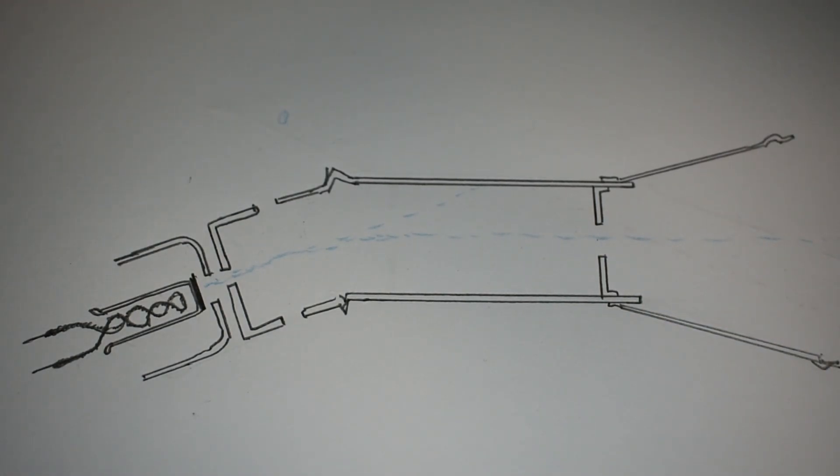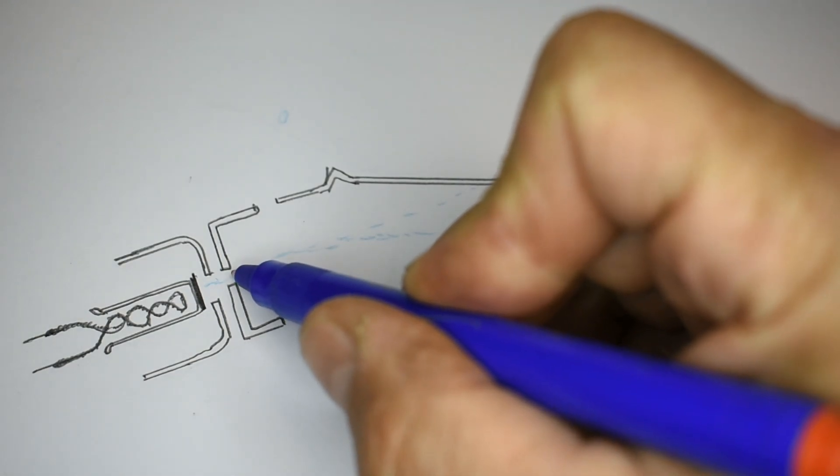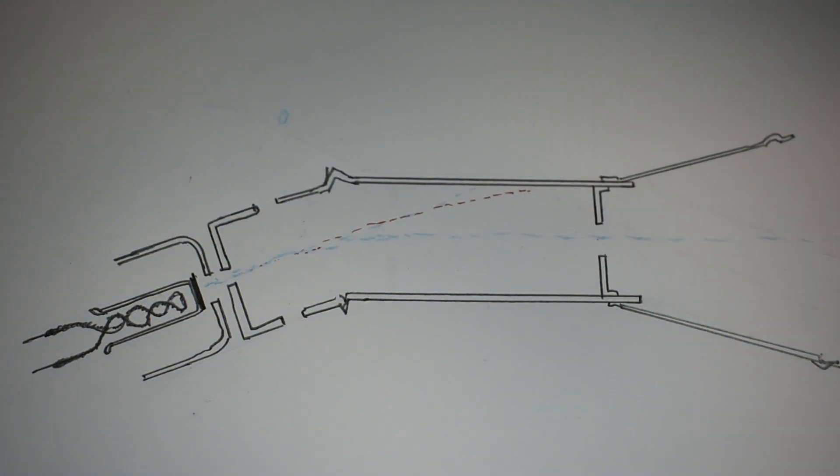Occasionally in the vacuum you would find ions or air atoms which had become ionized. These ionized atoms would follow a similar path but wouldn't be deflected by the magnetic field as much and would hit the anode wall harmlessly. If they hit the phosphor they tended to burn it over time. The later tubes got coated with aluminium on the phosphors, removing the need for the kink in the electron gun.